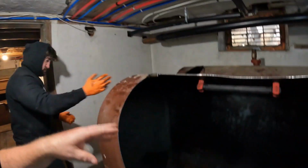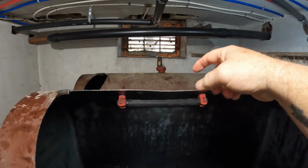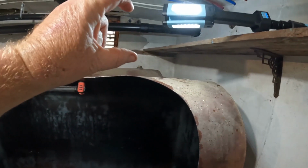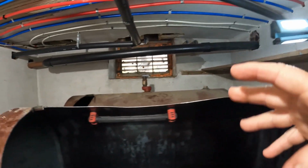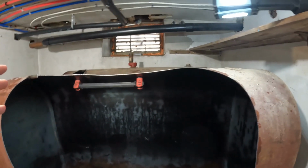So now we've noticed something. Every time we do manifold tanks, the way it's set up, there's always one tank that gets the first fill. All the fill goes directly into that tank. That tank fills up, and the bottom bleeds over with the crossover down below. That equals the tanks, so that when you have one sight gauge, it measures the two tanks as one unit. That's what that bottom crossover is for. When the tank gets full to capacity, there's a crossover right here on the top. Once that gets to 100%, it'll start pushing the oil up and over to fill it up quickly.